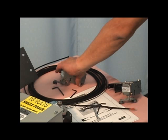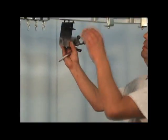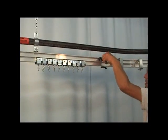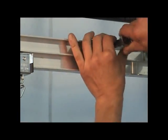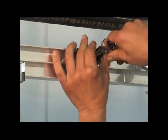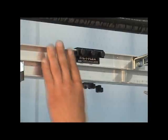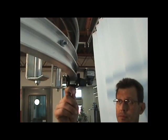Two track-mounted limits were provided with the system: one for the open position and one for the closed position. The open limit is mounted to the track in front of the stacked carriers. The closed limit is mounted at the center overlap. Mount the open limit switch to the track in front of the stacked carriers and loosely secure it with a 1/2 inch socket — it will need to be repositioned later. Make sure the limit rocker is positioned as shown; the knockoff master carrier must trip the switch when it passes.